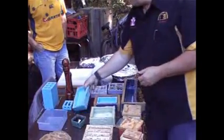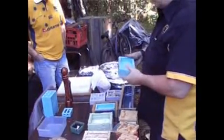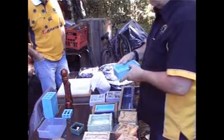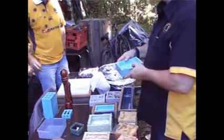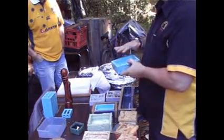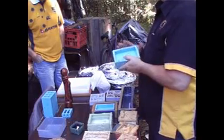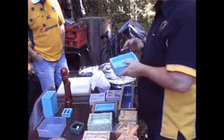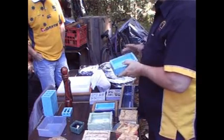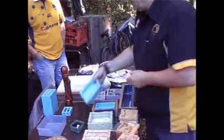These are the ones I buy from America now. Bloody good product. It is a soft mould though, and sometimes under pressure these bow out a bit. And they are made to the height of a blank, so for me it needs extra depth, and I'm probably going to pour some extra silicone on the top of these or make my own. There's a few block ones.